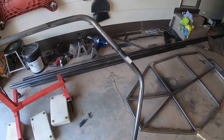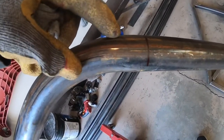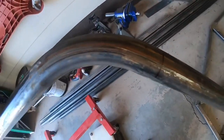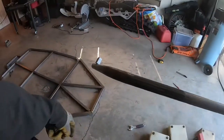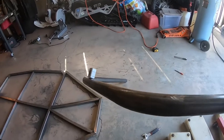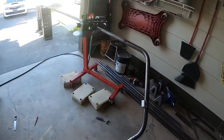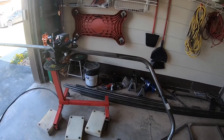Got that second bend done. My measured mark was at 453mm and I chucked it in the die right there — it started almost perfectly on that mark. There might be maybe a degree of difference but I don't think it'll be enough to affect it. I tried to take a time lapse of that one as well.